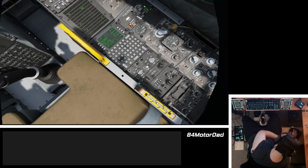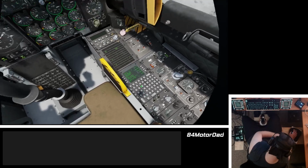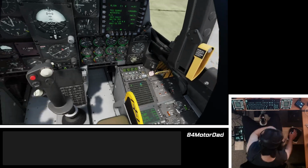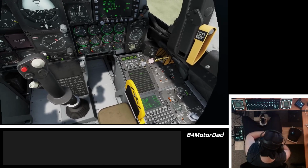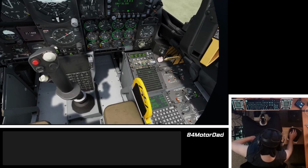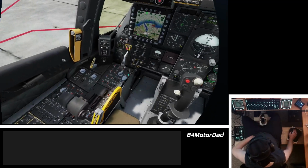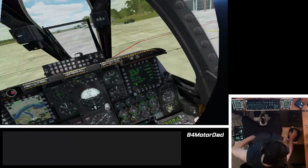With our flight and navigation systems ready, we can prepare some of the combat systems for the mission. Set the countermeasure signal processor mode switch on the CMSP panel to standby. For a combat sortie, you may want to review or create some countermeasures programs, but that is for another lesson. Now set the four system select switches to on, middle position. Next, set the joint tactical radio system, JTRS, switch on the AHCP to on. This will provide power to the Situational Awareness Data Link, SADL.